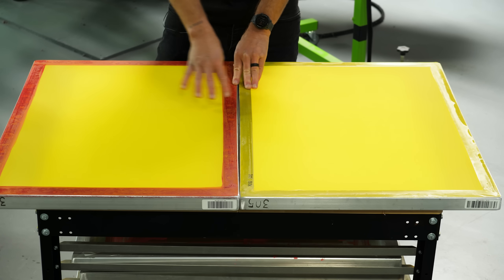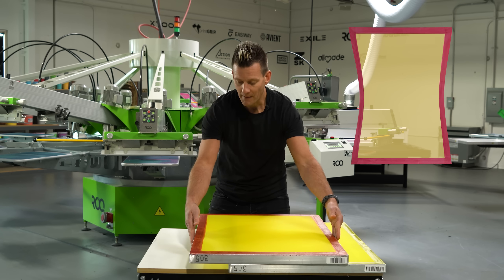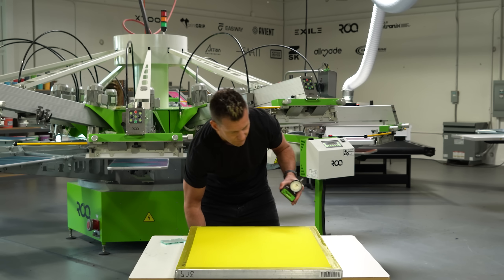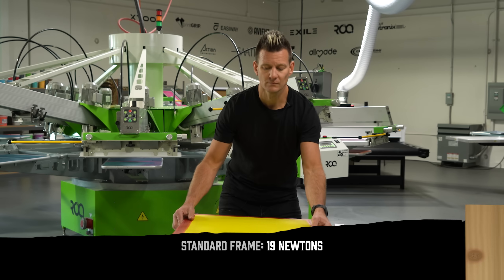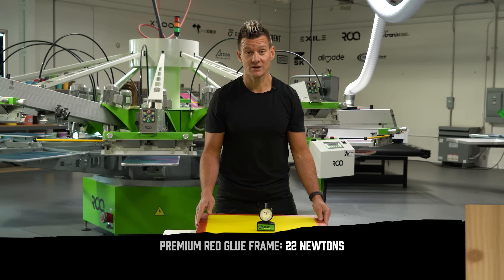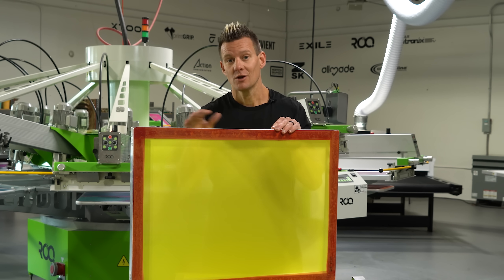Also, when these are stretched, they take a little bit longer to stretch and we pre-bow them during the stretching process. Pre-bowing means you're actually pushing the bars in during stretching, because the tension of the mesh going across the screen will naturally pull the frame in. But by pre-bowing it, it's going to naturally pull out when the screen mesh is cut out — resulting in better tension. The thinner lower-cost screen comes in on a 305 mesh at just under 19 Newtons, which is the low end of where you want to be for automatic screen printing. The premium red glue screen comes in at just above 22 Newtons — 15% higher — and it will hold better tension over time, because the glue takes longer to dry and has more time to harden, creating that better tension during the stretching process.